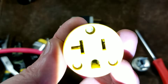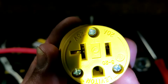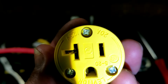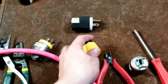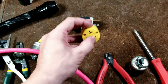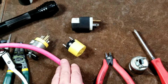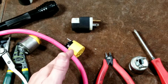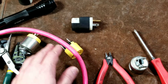I have a flashlight here, and inside you can see the heavy-duty plates. On the hot side there's a folded-over piece of metal with two ridges that press against the flat inner plate — that's really what makes a high-quality plug. Whenever you look inside cheaper plugs, usually it's just a couple pieces of metal that go onto each side, and on extension cords it's even worse: it's actually a piece of sheet metal with a slot stamped into it, and they make a terrible connection. Even on 12-gauge extension cords, it's surprising that they do that.